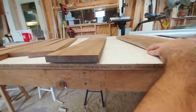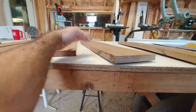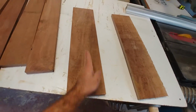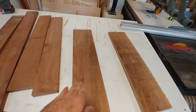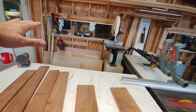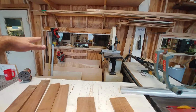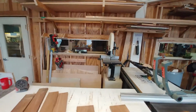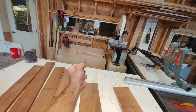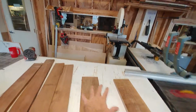This is still a piece that is sitting up and taller on that side all the way down. There's just nothing left in here. Even if I were to make thin pieces, each of those are going to travel like that. If I had a complicated arrangement, like a Japanese style, I believe, for clamping, I could shut all these strips up with glue like I originally intended. There's another style of clamping where there's a surface somewhere above the table, and you cut slightly overly long strips of wood and deflect them and stand them in place, and then let them try and straighten out, and it will push downward for you, and you can place them anywhere you want if you have trouble.